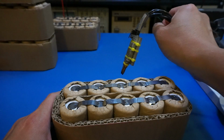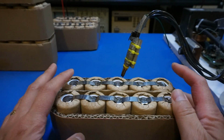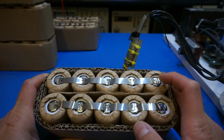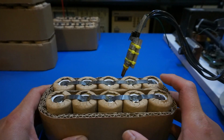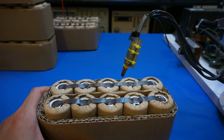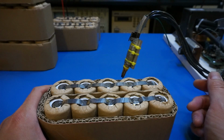And these wires are sufficient, so they're not that warm. So a little bit about the welding. A lot of people say that it's really how much energy you deposit into the welding point. And the typical weld for this size is somewhere between 100 joules and 200 joules. So the current measured through this cable is actually about 300 amps.